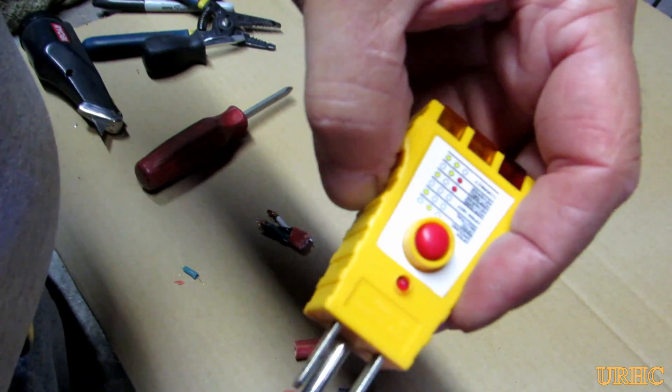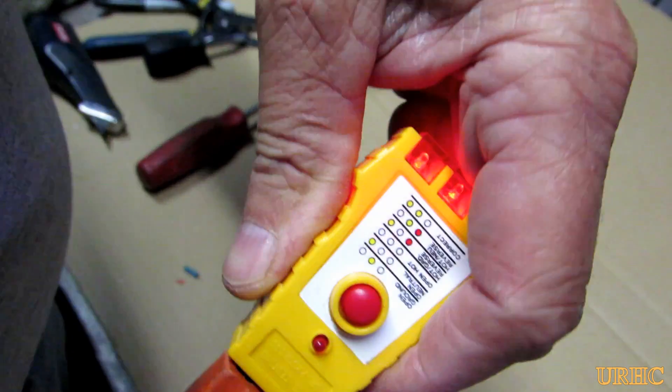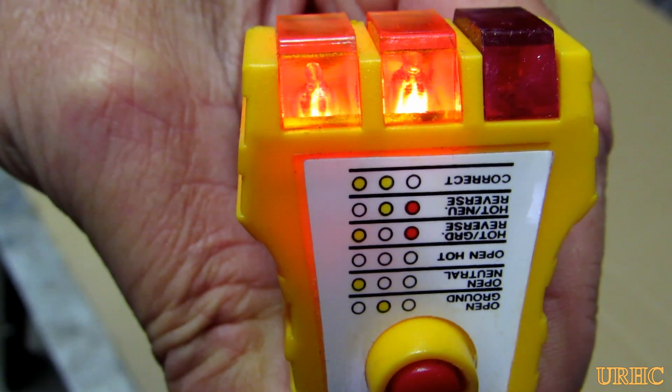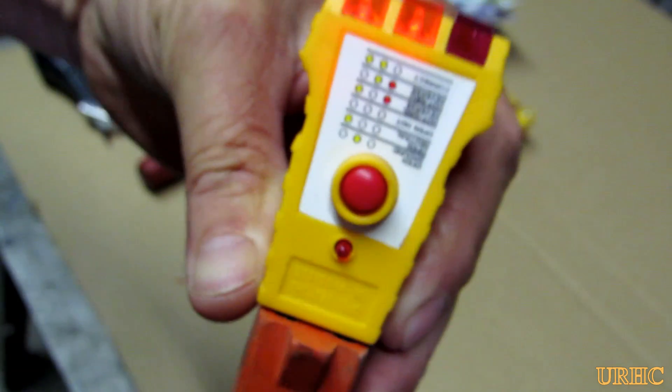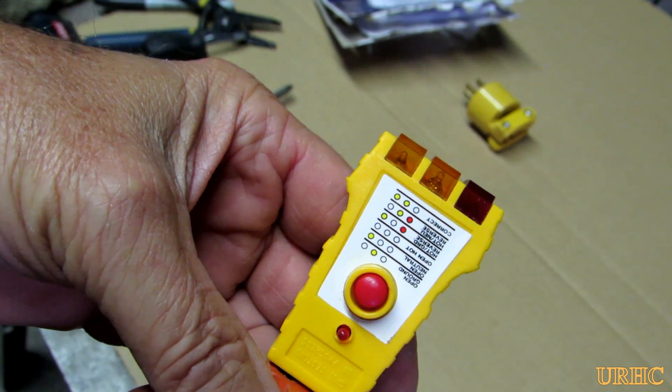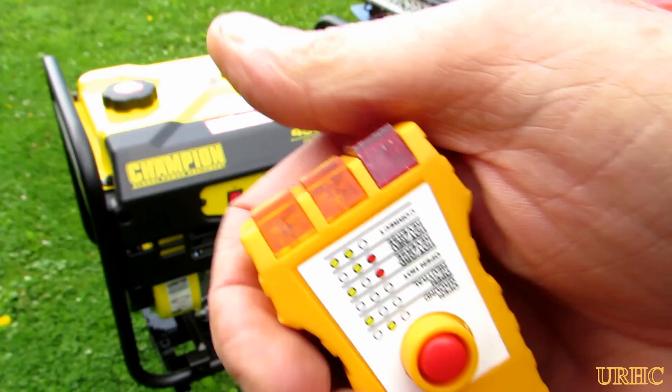Here I am — I plugged that into the wall. Now I have this tester for wiring to check, and you can see there that the wiring is done correctly. Anytime I mess with electric, I use this tester. I hit the button there to test the GFCI capability, and you can see when I press the button, it worked instantly.